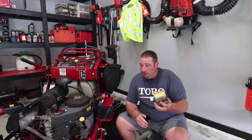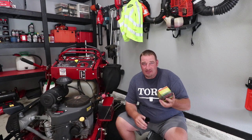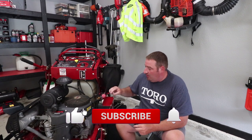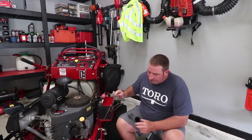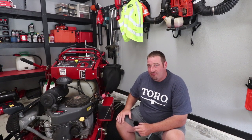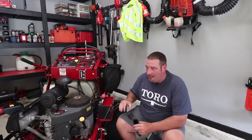The filter number for the Grandstand FX691V is 49065-7007. Also, my fuel filter gets changed about every 100 hours. My air filter, I check every 50 hours when I change my oil — the manual recommends every 100, but I personally do it every 50. I feel better about that.